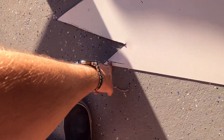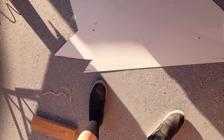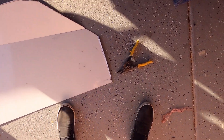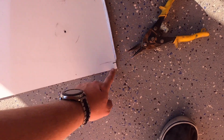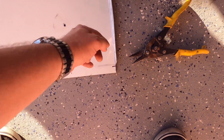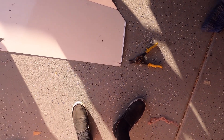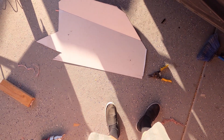Right here I'm going to put about a three-quarter inch bend, three-quarter inch there. We're going to put it in the brake and make it even better, down to about 90 degrees. Trim everything up. When you make bends that are going to go over bends, you've got to trim them. So here's my bend right here — you can't bend over this crease right here. Quick little tidbit. I'm going to set you up on a time-lapse and show you how I do it.